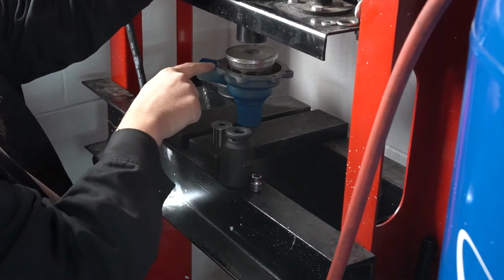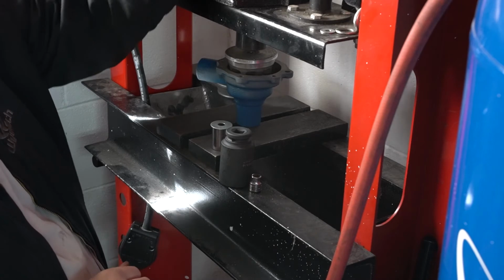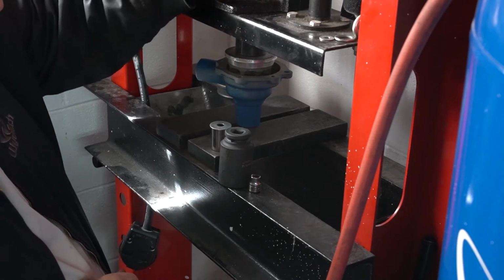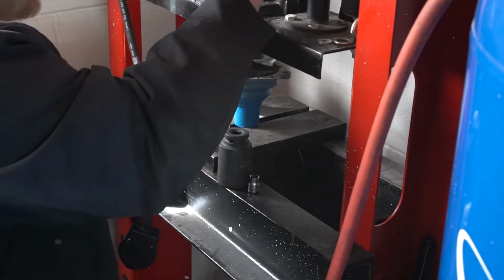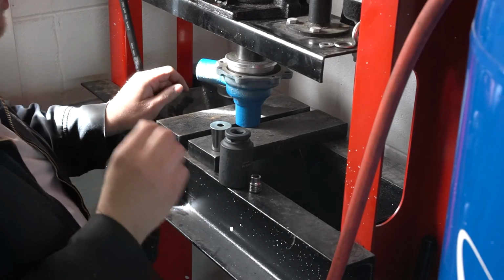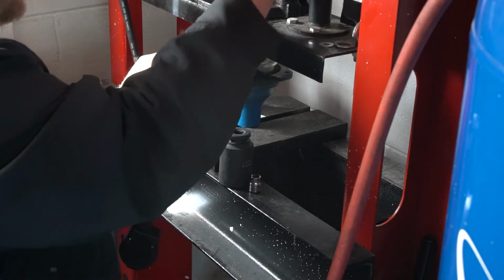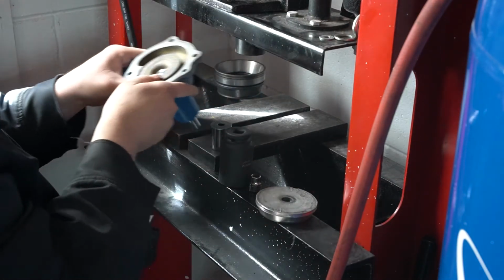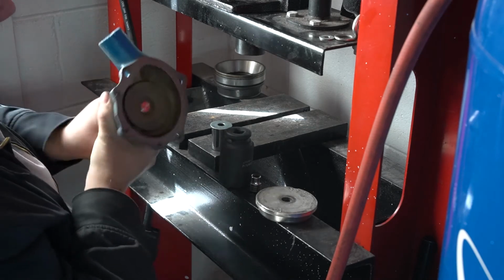Now on the impeller, you want to line it up to be just below the surface. I think the manual calls for like 15 to 25 thousandths. Now that seal that we put in, that center section is going to move. And you want it to be able to move, that way it presses against that impeller. That's what's actually creating our seal. We're still freely moving.